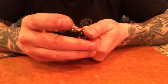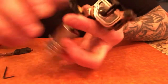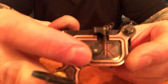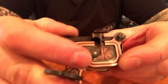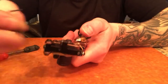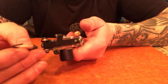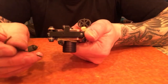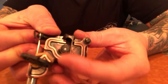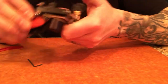I'm just going to check it again from my side. I like to close one eye — almost like shooting a rifle — so you can see the lines match up better. Look at it straight on with one eye closed and you should be able to set those lines. It is set right. Turning the impact screw clockwise raises the armature bar and adjusts the cam line — you just want those lines to match up with the armature bar pushed down. Once this is set, it's time to check how your machine runs.